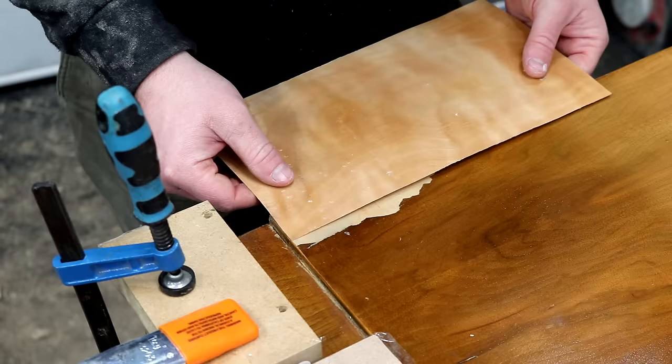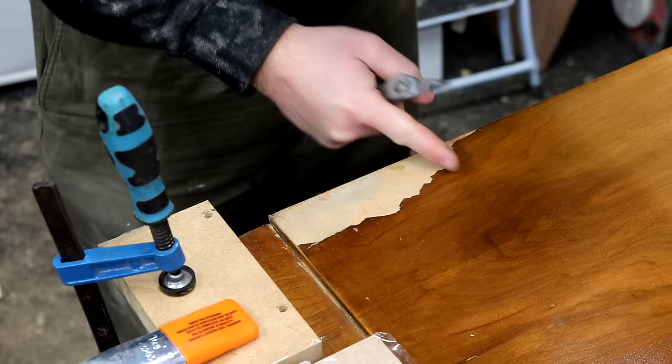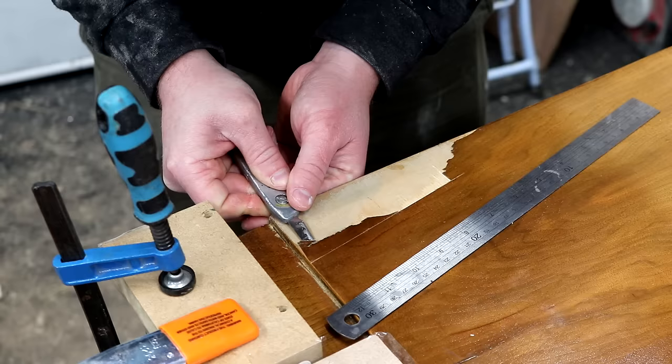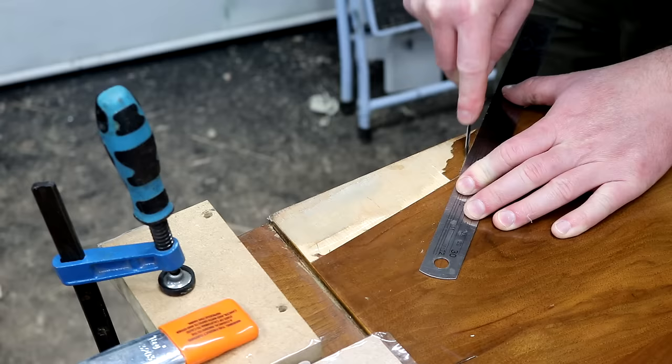For this large area here I'm offering up a veneer and trying it out in various different orientations to try and get the best match for the wood grain. It's never going to line up perfectly but it's nice to try and match it wherever possible. I'm going to cut away the loose veneer using a steel rule to guide the knife to give me straight lines, which is going to help me to cut an accurate replacement patch.